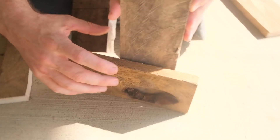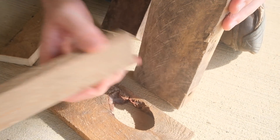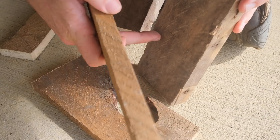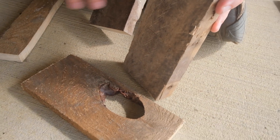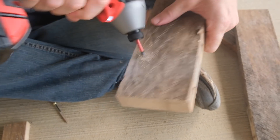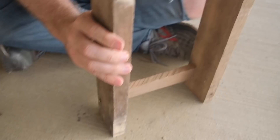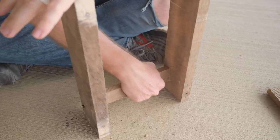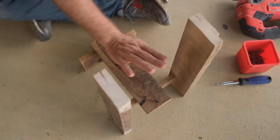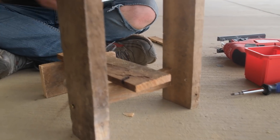I'm going to make sure this is in the right place. This isn't the piece we're hinging, but that's the full height. This is the actual piece we're hinging. All I need to do is put a screw through at some level underneath that line, about the same on both sides. Counter-sink. So we put it in and then I actually just back these up a little bit so that it's pretty loose. What you want is that when it sits there, it's very easy to spin. You want a little bit of space in the back so that when this thing swings up and down - remember, you're going to have a solid wall across here - when that swings up and down, you don't have any issues.